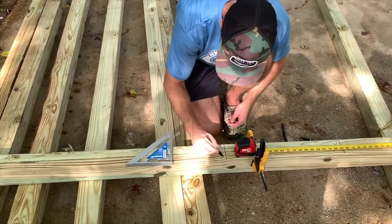Hope that makes sense. So to install the first shingle, we're taking a full length run of shingle and we're gonna line it up so that the back of the shingle is right up against the chalk line that we established. What this is gonna mean is that we're gonna have a 1/4 inch overhang over the starter strip, and you also wanna position the shingle so you have a 1/4 inch overhang over the rake side drip edge. Once you have your first shingle in position, you're gonna install 4 nails into the target nail zone as shown in the figure.